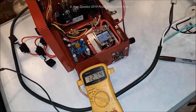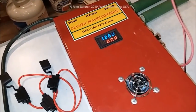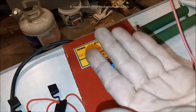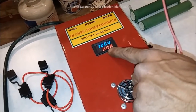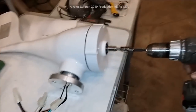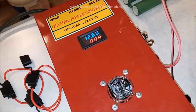We're going to go ahead and close this and I'll give you an amp reading. We're back down to 12.6 — that's one tenth off, which is very common. You can adjust these to get them a little higher, but as long as that fan is running it's pulling this down a little bit since it's wired in the same circuit. Watch for this amperage right here as we spin up the turbine again.